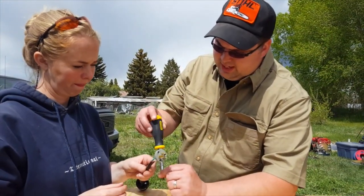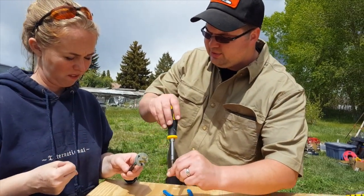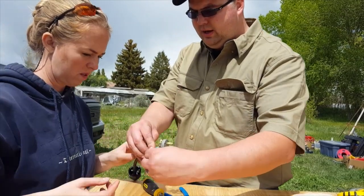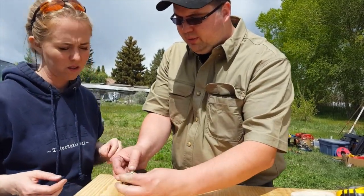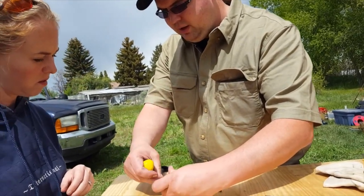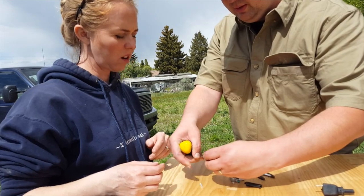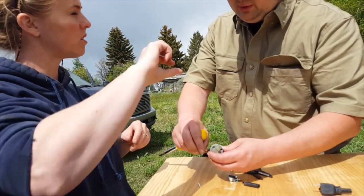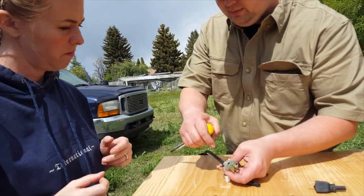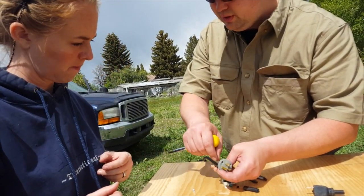The reason for that is you tighten that screw — it'll suck it in tighter as opposed to kicking it out. So what should I do? Just like you had it, but you were going to put it in there like that. And as you thread that screw, it'll want to push it and kick it out as it spins. So if you do it like this — you want to bend it around in the way you're going to be twisting it. If you have it like that, it's held in place by the cabling and it'll hold itself in place while you tighten it down.